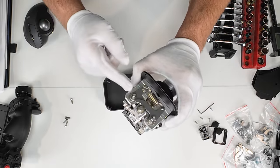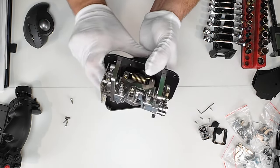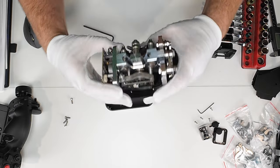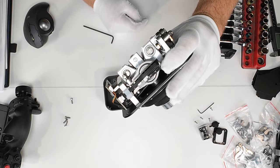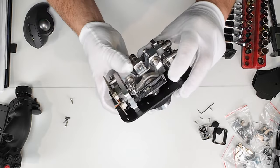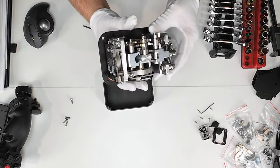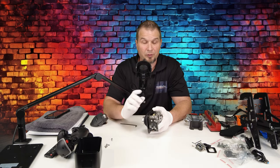The cams that we're going to be swapping out — you have a set of cams here and here that are going to control forward and backwards. Riding on these cams we have bearings, and on all of the other pivot points are bearings as well. It looks like we have a hall sensor for the side and on the front, and this is going to detect the position of the joystick itself. You want to be very careful that you don't damage these boards when you have this apart and you don't want to drop it in this state.